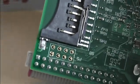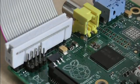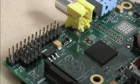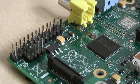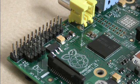The reason why it's labelled on the bottom like that is because the header is supposed to go on the bottom, but that in itself throws up some interesting problems. So today we're going to explore ways of solving those problems. That was possibility number one — a straight header on the top side. Rejected, because you can't use add-on boards and ribbon cables and all the pins at once.